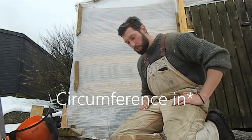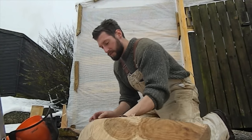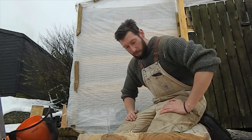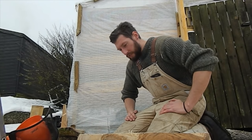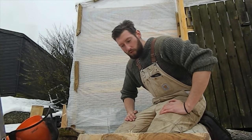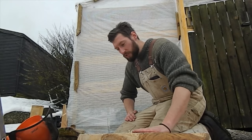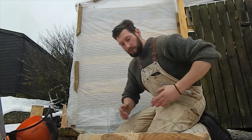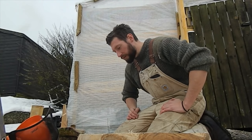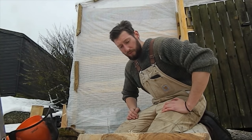For boat building, boats are wet, they're always sitting in salt water, hopefully. So why is having dry wood important? Well, honestly, it's not massively. What you need is wood that is going to be the same moisture content as your boat, so you don't get too much shrinkage or changing of shape. Now, generally you want to season wood a little bit to allow you to see if it's going to dry twisted, or show up any weird defects or any sort of checking, so you can really see it. But if you're careful, you should be able to use a bit of green oak in what you're doing.